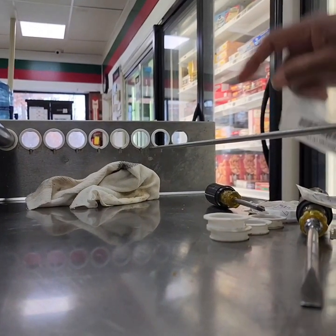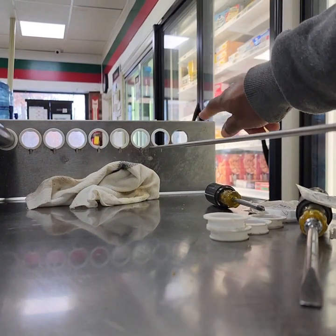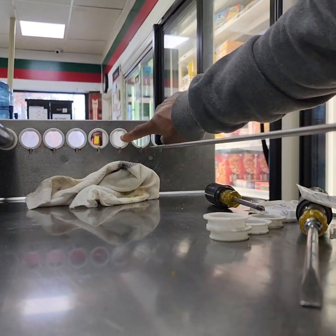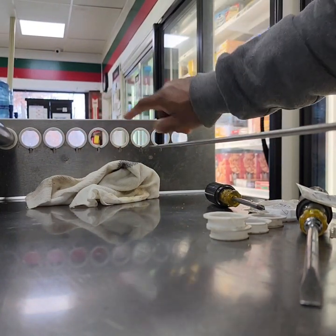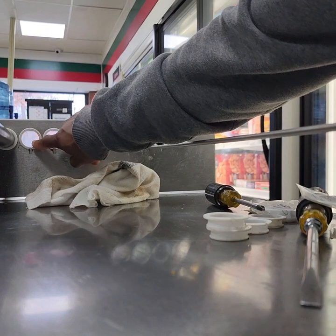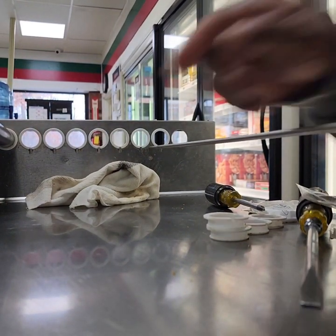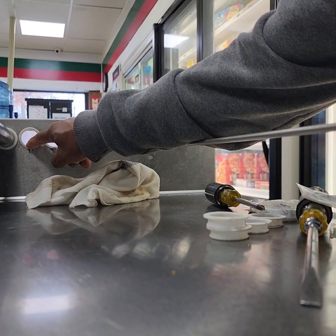Now, as you can see, I've got those three bearings in there. That last bearing, this first bearing here, and this bearing here are going to be different than the rest of these in the middle. It's hard to picture, but this one is the part number that ends in 400, and the one on the opposite side is going to end with 401.